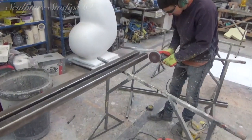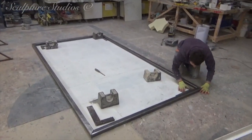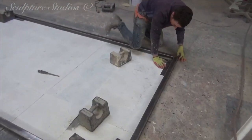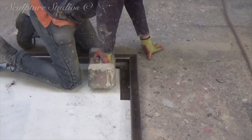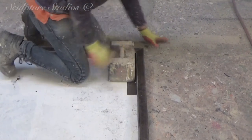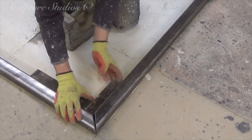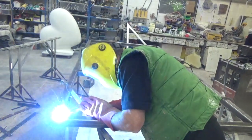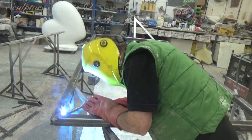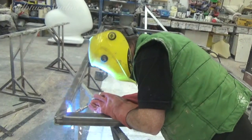Here we're starting on the metalwork underside of the table. We're using box sections of mild steel, which is going to be strategically clad to make it look as though the entire table is solely made from wood. The reason for the metalwork is that this table needs to be strong and wheelable on and off stage — but we're not simply adding casters. This is going to lift up onto its wheels, be moved onto stage, and then dropped to the floor in position. The reason this needs to sit tight is it's going to have people standing on it, and it's also going to be on a raked stage, so we don't want it rolling down onto the audience front row.